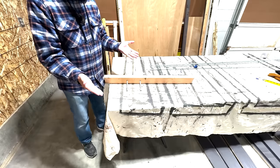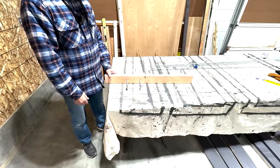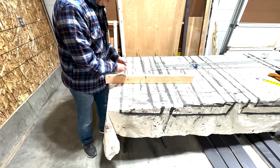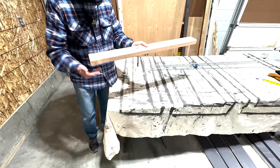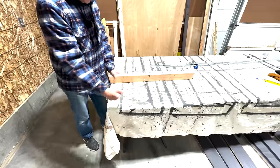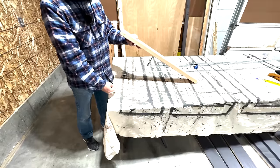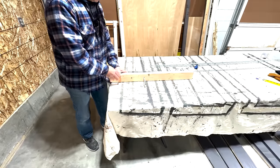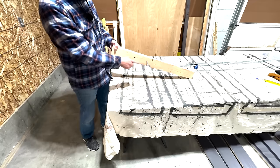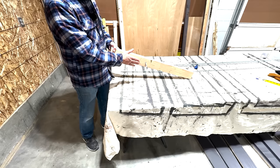My reason for doing it that way was that I knew it would be several months before I built the smart shelves, and I didn't want threaded rods hanging down — it would just look bad. The other way is to simply run your full threaded rod from below: drill a hole through the ceiling, put it through, add a washer, nut, and thread lock, and hang the full rod down. But this coupler method is what I prefer, because it acts as a disconnect. If you ever want to take the shelves down, it's much easier.